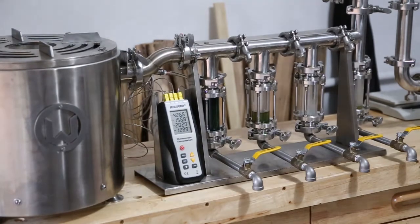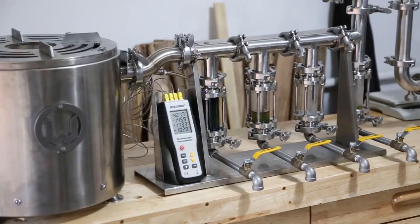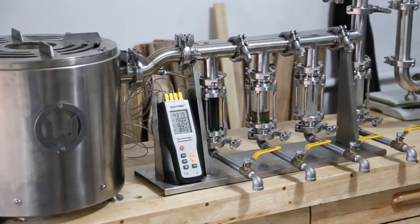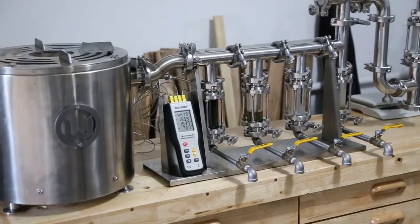Fuel sort of hangs out here — we're making fuel at 424–430 degrees and it equalizes out. The number two thermocouple, which is in the retort at the catalyst port, is always reading low, which I suspect but don't fully understand. It doesn't make sense to me that it goes down there and then back up in column one. The thermocouple measurement is also auto-turning off every few minutes, which is why you see Ben and me resetting it — it's irritating.